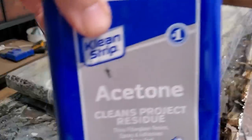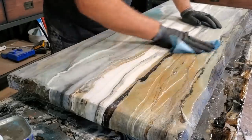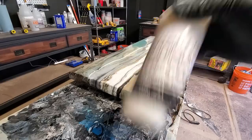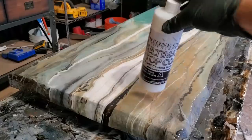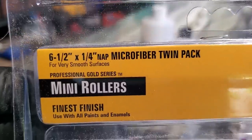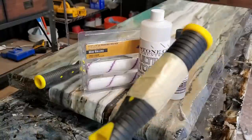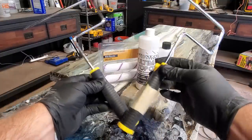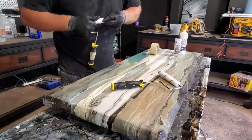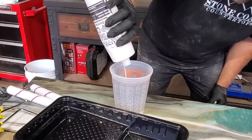Time to wipe away any of that sanding dust — you can use either acetone or xylene. We're going to prep the bottles of our ultimate top coat by first shaking part A, then getting our rollers ready. We're using the two-roller technique. A one-quarter inch microfiber roller is very important. I'm going to mark one of my roller handles with tape because I'll have a wet roller and a dry roller. First, remove any loose hairs from these rollers by rolling them across some painters masking tape.